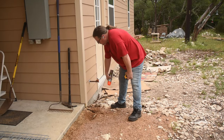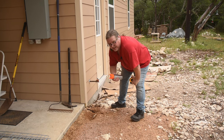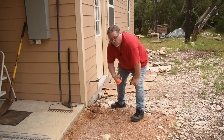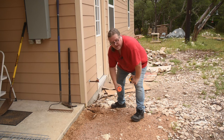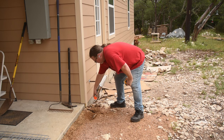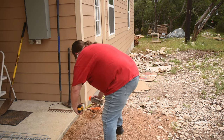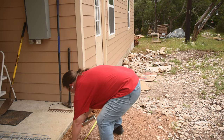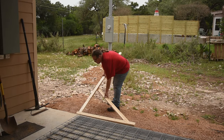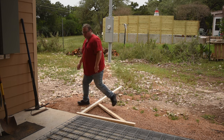Now in this part of the country, you kind of clear off the few inches of topsoil before you get to something hard, before you can dig in. So real quickly, I'm going to lay out where I think the posts will be within about a foot. I'll draw myself a good foot, and that'll be the hole I'm going to dig in the future, just to clear away stuff. The first one is going to be right at the center post, and the next one I'm just going to put 40 inches out to give myself a nice large door. And then the square comes in. I can bump it up against the foundation, lay it out, and I've got my straight line to mark my next point.